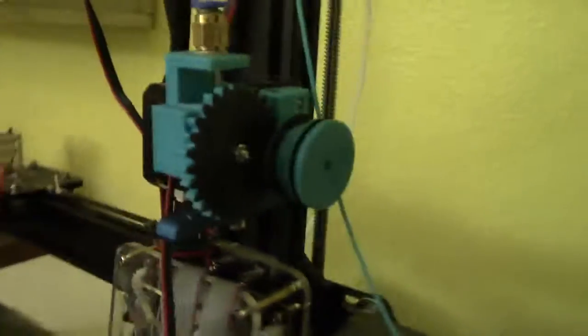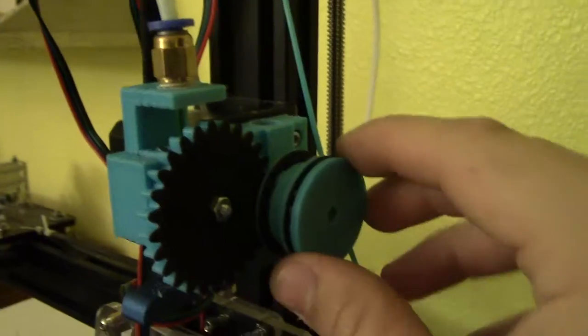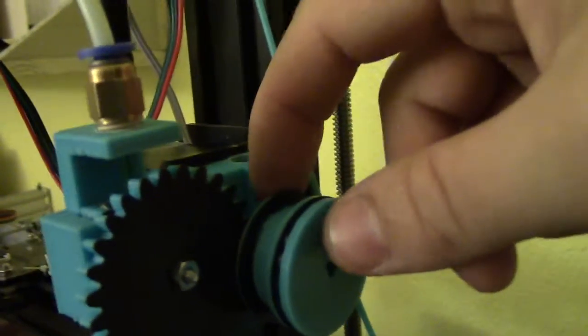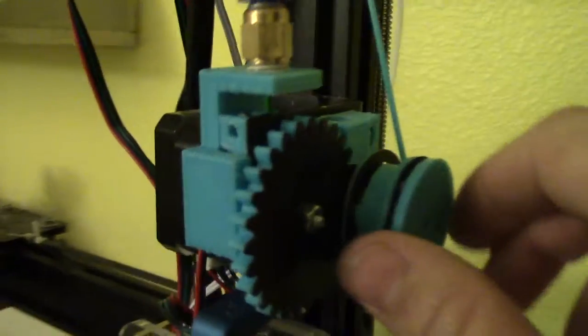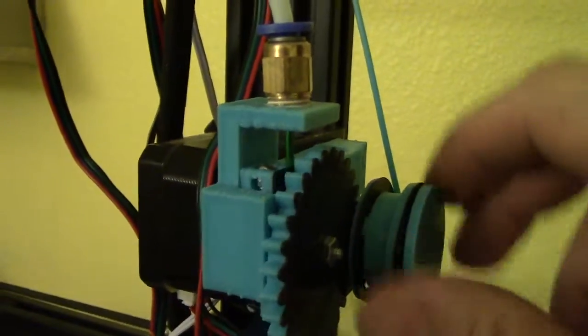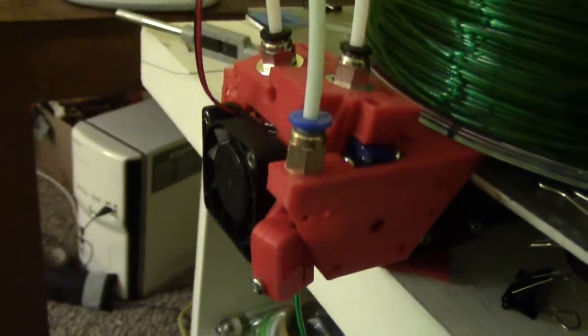On this end, I also did quite a bit of addition. This is a little bit bigger and that gives it more torque to push the filament through. There's the magnet wheel, there's a small pinion gear attached to push down here, and then a bigger gear here. That big gear drives the pinion — it's a rack and pinion kind of design. So you can see that goes up and down, and this will be the extruder. When that spins, it will push it into position, going all the way over and pushing that up and down.